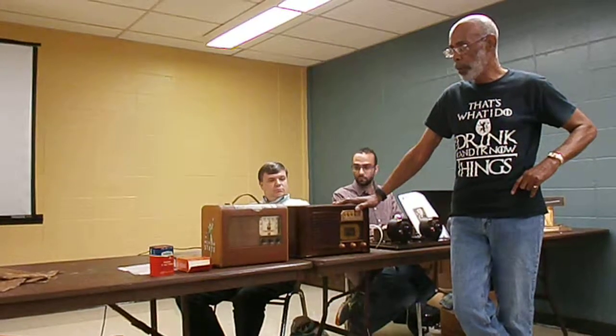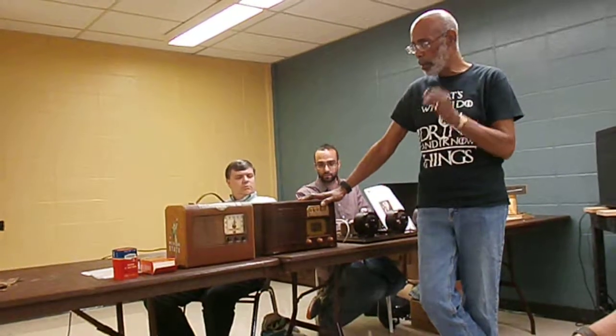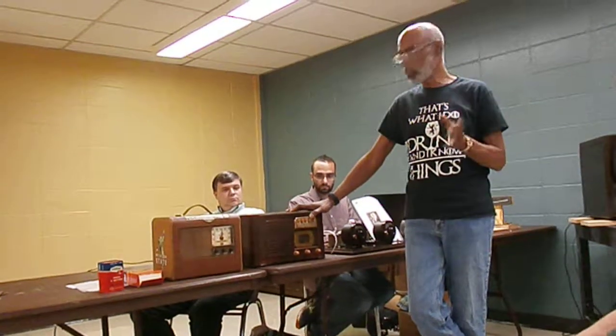I didn't take it up very far, but then I started checking the tubes, and the 6X5 was dead, and the 7B6 was dead. So I had a 7B. No, I didn't have a 7B6. I had a 6X5. 7B6 I had to buy. And that was a real primary tube in this radio. So when I got that tube, it worked. Low volume hum it had, but it worked. So then I put it on my stand and started tearing it apart.